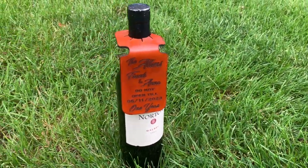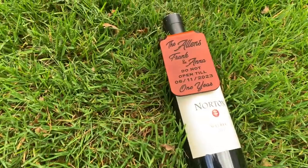That was the video of laser engraving and cutting with the K40. For the engraving I was running at 250 millimeters a second at 23 percent power, with the air assist at about 10 to 15 psi. For cutting the leather I was at about 70 percent power with the air assist up around 25 to 30 psi to punch through the leather. Here are the finished tags — the customer's theme is anniversary milestones: one year, five years, ten years married, with a bottle to open for each. These leather tags came out pretty neat and will definitely last a lot longer than a paper tag on the wine rack.